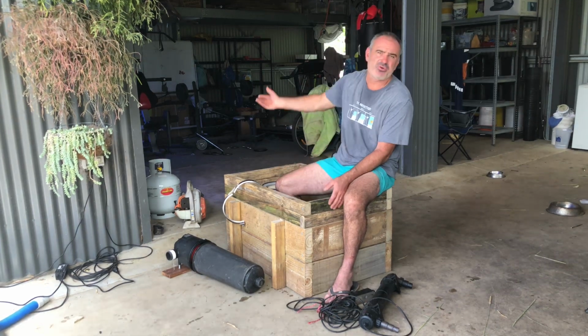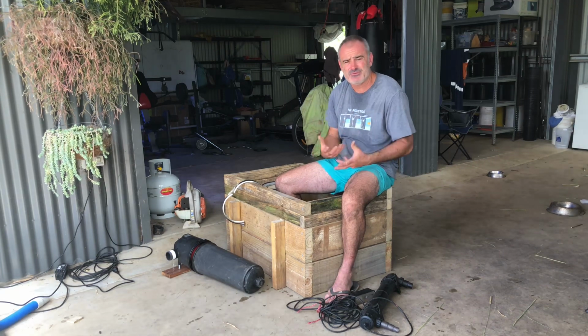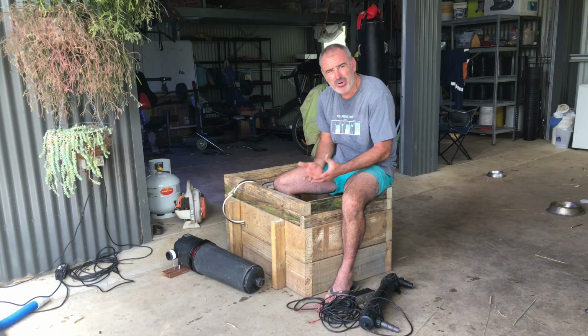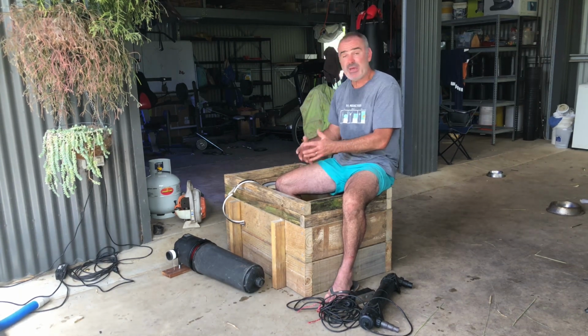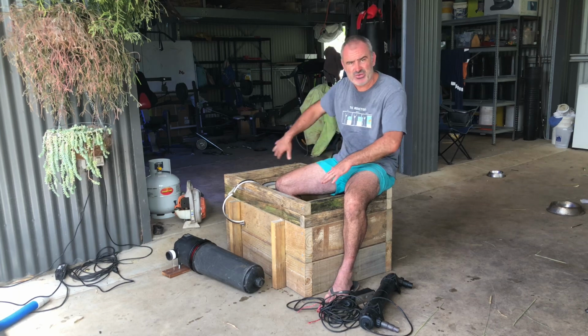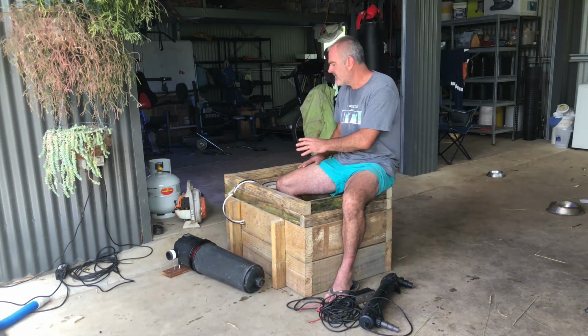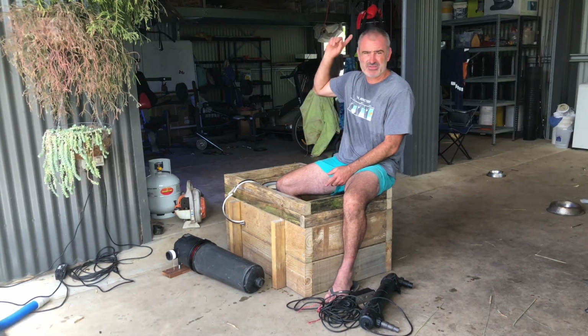If it's below, the water drains down to it. As it enters the sump, it can go through mechanical filtration media or a filter sock. It can then go through biological media if you have it. The water then can be heated if you need to, so you can hide all your gear down in there, your heaters, etc., your plumbing. There's a return pump that sucks the water and sends it back up to the tank.